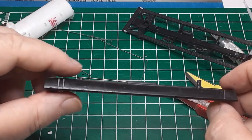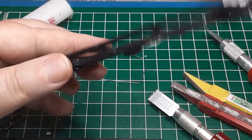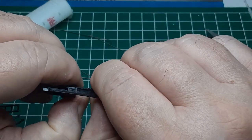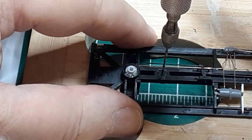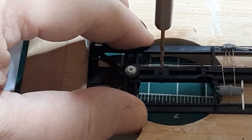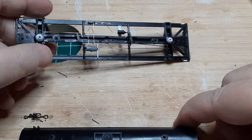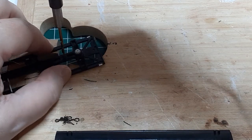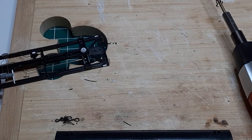Next, I need to fabricate new attachments to hold the tank assembly to the underframe. I start by cutting off the good pin, then I will glue it into its hole to provide an anchor for the tank screws. I want the glue to cure thoroughly before I drill the screw holes, so I'll do some more work on the underframe first. Then I drill a pilot hole using a number 65 drill bit, which allows me to ensure the hole is centered on the mounting pad. Next, I drill a 1/16th inch hole following the pilot hole — this will be the guide for the hole drilled in the underside of the tank. I carefully line the underframe on top of the underside of the tank, and when I have the parts positioned to the best of my ability, I drill a 1/16th inch hole in the tank underside. I have two 1½-inch long self-tapping wood screws which will fit these holes nicely. Finally, I drill a 1/8-inch hole through the underframe — this hole is large enough to allow the screws to turn freely.